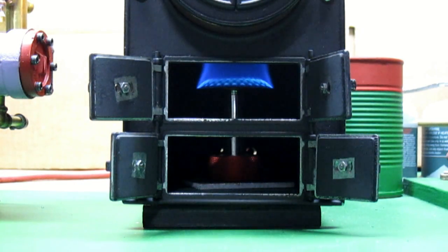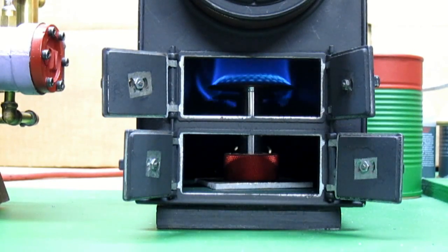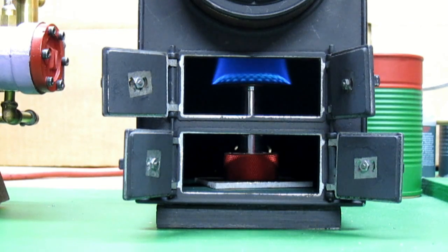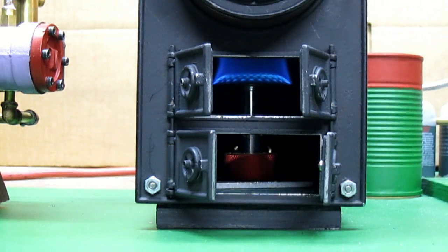It's going to pop. It lit. Now once it's lit I'll adjust the gas down so it won't have too much gas back there. You want to be very careful not to let the flame go out, because you don't want to have a boiler furnace full of unburned gas — when ignited it will blow those doors open with a pop. It's hard to see but the other burner is burning. It'll take a while. I can probably close some of these doors. I'd like to keep an eye on the flame — it'll take perhaps 10 minutes for the boiler to heat up and have enough steam to run the engine. I'll sign off for a minute and get back to it when the boiler has enough steam to power the engine.